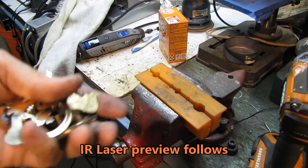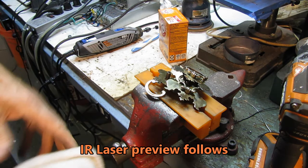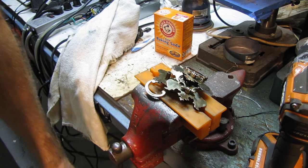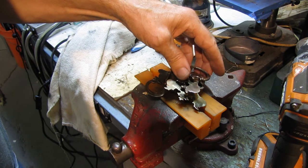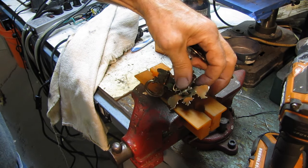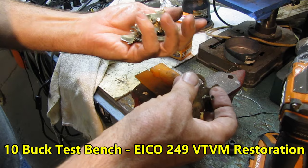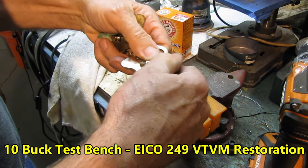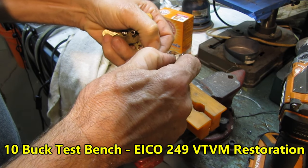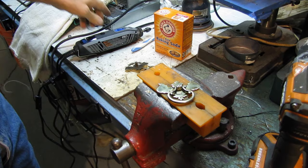Thanks for stopping by, and don't be afraid to try some of the plating — it really isn't very hard to do. All you need is a little power supply, a little bit of baking soda in a bucket, and some sacrificial pieces of copper pipe. Or if you're doing a chassis, you can buy zinc sheet at the home improvement store and plate your own radio chassis. They come out pretty good. Go back and take a look at that Ico video where I redo the chassis — I'll dig up the link and put it down below in the description.